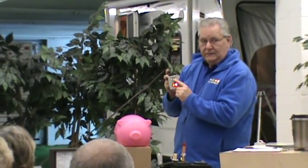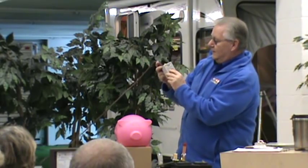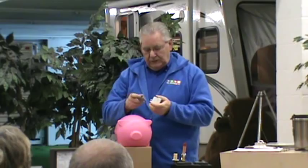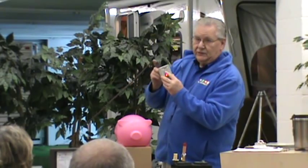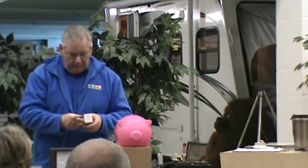And these two lights up here are not lit, for a reason. Two lights not lit means open ground. That's because I'm using one of these adapters on here. This is a three-prong with a ground, and I'm plugging it into a two-prong. It tells you if it has the correct polarity, one light will light. If it's a reverse polarity, the light on the other side will light. Open neutral, both lights will light. No lights, it'll have an open ground.